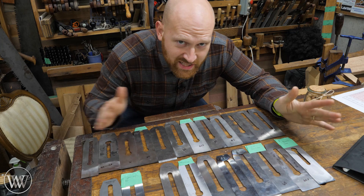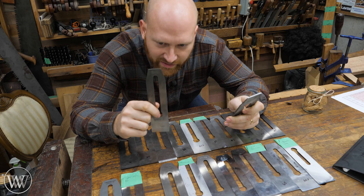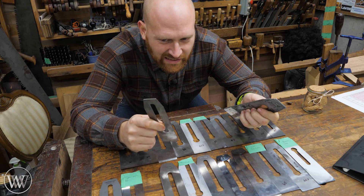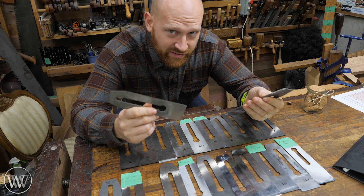Let's take a look at these irons and some of the specifics. First, we're actually going to test two old irons — old stock irons. A lot of people asked me to test different ages of Stanley, but the problem with old irons is that before computerized testing, batch to batch they were very different. You can get Stanley Sweetheart and in the same year have another batch that is a wildly different steel. Very small changes can make a wild difference in the iron, so these ones are more or less controls.